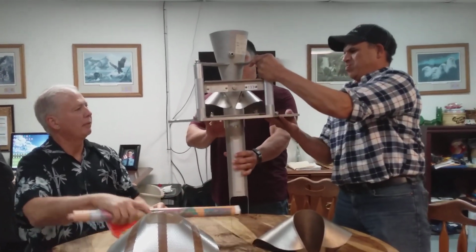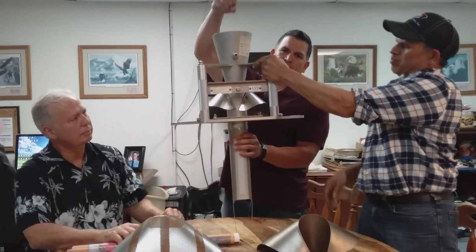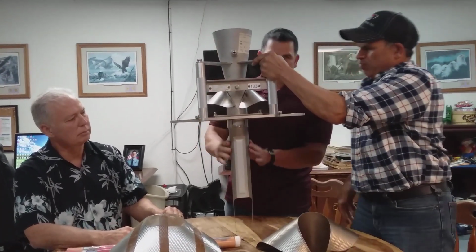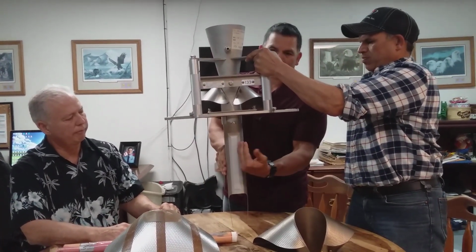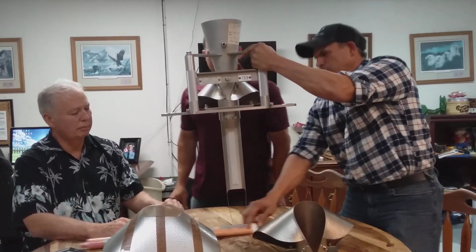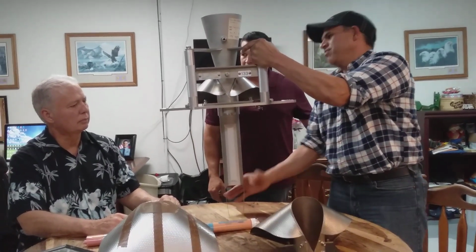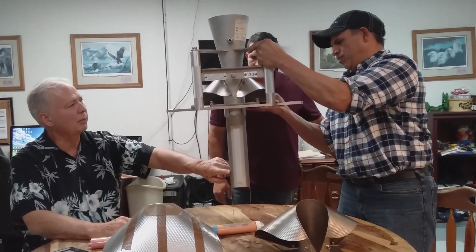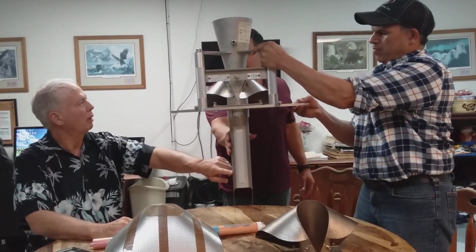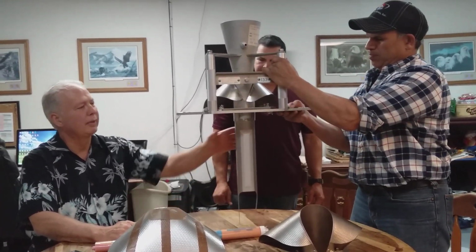The film comes up the backside and rolls in between the collar and transition. Food is dropped to the scales from the top. Belts are pulling, and you've got a heater bar in the front, which makes your seals. It's called a forming collar because the film actually forms and goes up and down into the shape of the bag. Okay, and what do we call this here? This is the transition filler tube. Transition filler tube. Okay, got it.